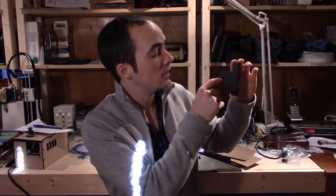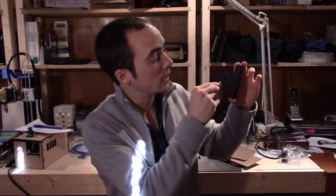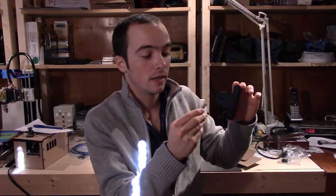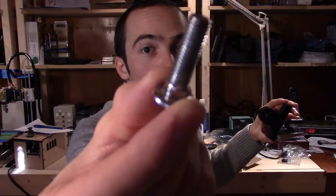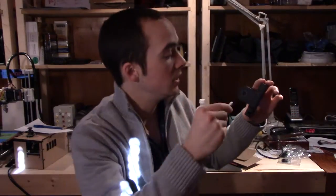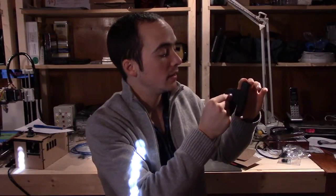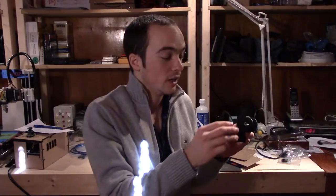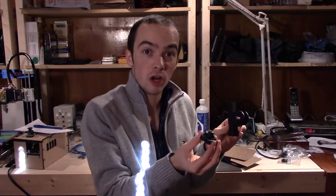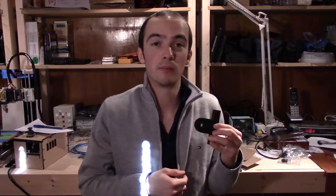And then another situation where this occurs is with this little square hole to fit the carriage bolt. So this carriage bolt gets inserted into here, and the threading is just like a normal bolt, except at the bottom, it's got a square shape. So you could fit that in perfectly, and it will remain in that position, right? It's not going to turn when you're tightening it from the other side using the knob. So that's a handy little mechanically engineered feature, right? That keeps it from turning. Very simple, but I can't print it.